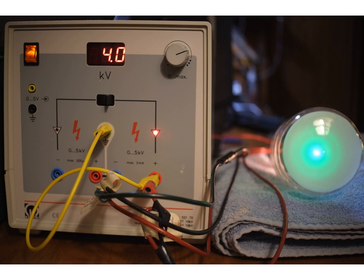However, we're trying to study how the wavelength of the electrons depends on their energy or momentum. That means we need to have data over a range of voltages, and to get a good range we need to go down to some very low voltages that are considerably lower than the tube was designed to be used with.